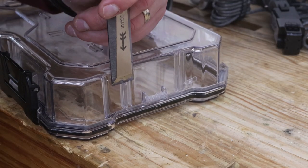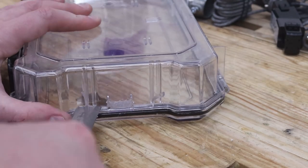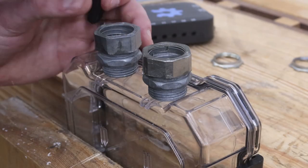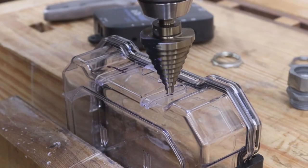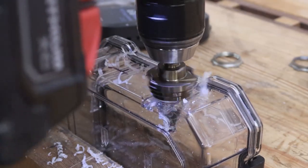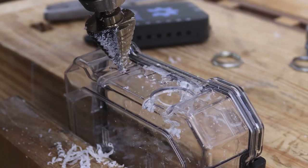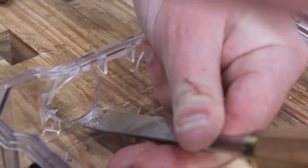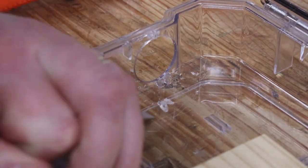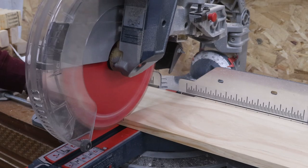I'm going to route the CT wires through conduit, and since this plastic box isn't really meant for this purpose, I need to make some modifications. To mount the box to the wall, I'll be affixing a piece of wood to the concrete using some tapcon screws.